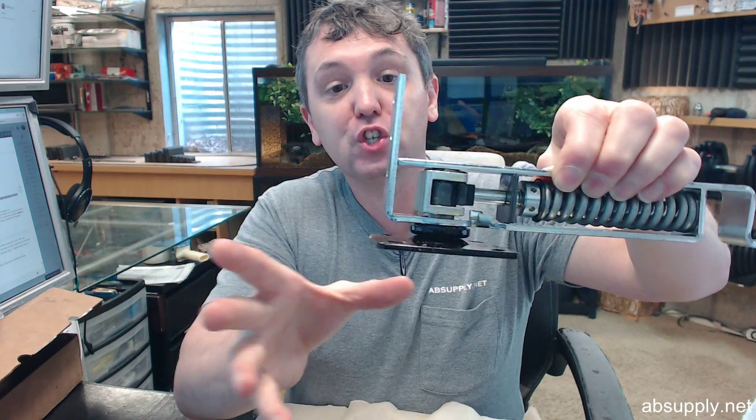Now, not to give away the punchline of the joke, so to speak, this is the floor plate. A jam bracket would sit underneath this and then allow you to attach it directly to the jam. Why would you want that? Well, these holes that are slotted here, you may not be able to drill down into the floor for whatever reason. It could be the fact that you've got a floor that is quite costly to replace should there be a cracked piece of marble. Or it could be an installation where you cannot pierce into the floor. It might be a sanitation sort of perspective. Or you might just simply prefer to mount it to the jam rather than to the floor.